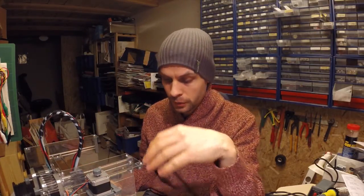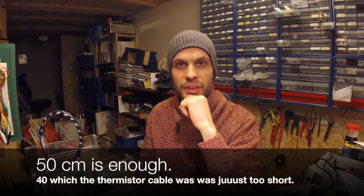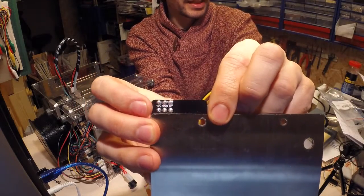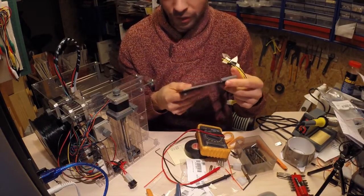First things first though — I need to remove my hotbed again so I can move around. I have John Buford's Macibox Assembly Step 8 on the computer so I can follow along and make sure I do it right once I get the cable done. I can see he has quite a long cable — I think it's almost 50 centimeters — so I just have to measure in here first. Here below this little plastic piece, it says exactly what we're looking for: plus 12 volts on the outside, ground, and RT — the thermistor.